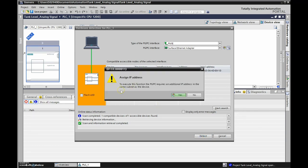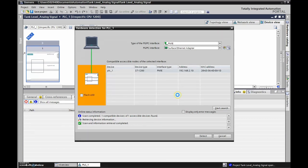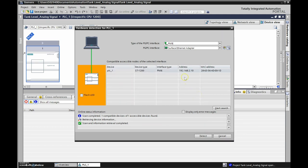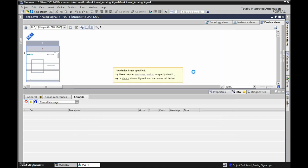Since this is a direct Ethernet connection from my computer to the Siemens PLC without a router, it'll ask for an additional IP address in the same subnet as the device. It comes up with 192.168.2.241 added to the interface adapter. It'll show this address but in the background will be talking to the other IP.